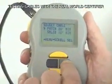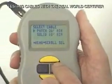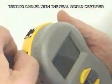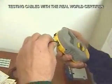You had a nice way of figuring out whether you were dealing with a patch cable — with the magnifying glass. If you saw a stranded cable, it's a patch cable. That's very nice about these connectors — you can just look at them and see the end of the wires. I just use a little magnifying glass and I can look at them and know right away. You can also pretty much tell by how flexible the wire is — it's a patch cable if it's flexible.